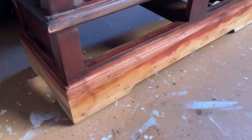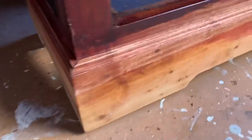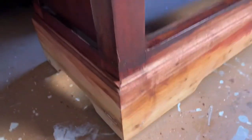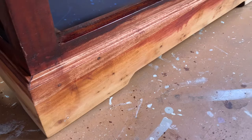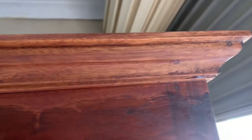See you soon. Hi guys, we've taken all the citrus strip off there, and as you can see, it's taken the varnish off, but it's left this horrible orangey stain, which it's done a few times. I don't know what I'm doing wrong, but I'm going to try a bleach process now. I'm going to bleach all that stain back out. As you can see on the top, it's taken the varnish off, but it's left the stain. So this wood should be like the drawers. So maybe we try a polycell stripper next on the next one.